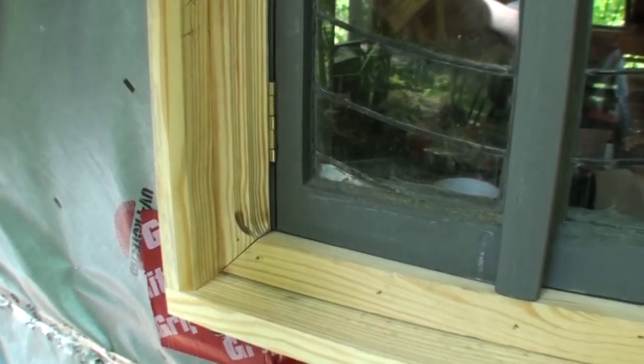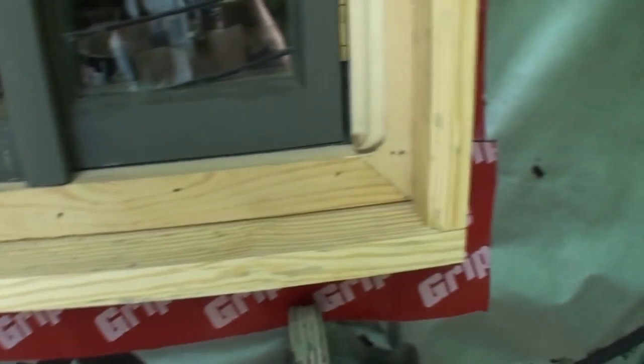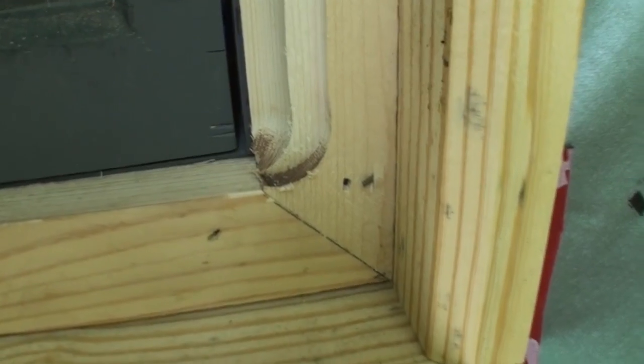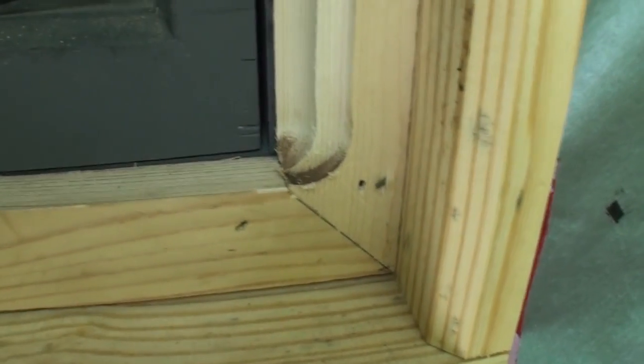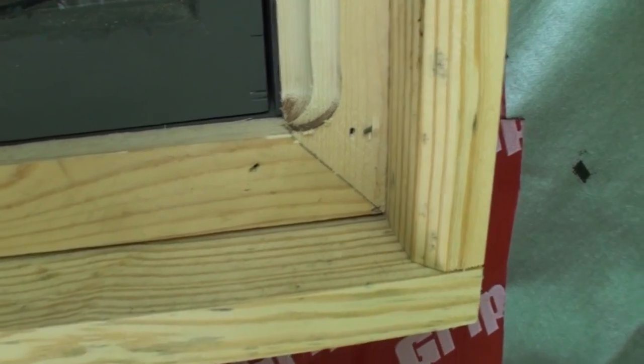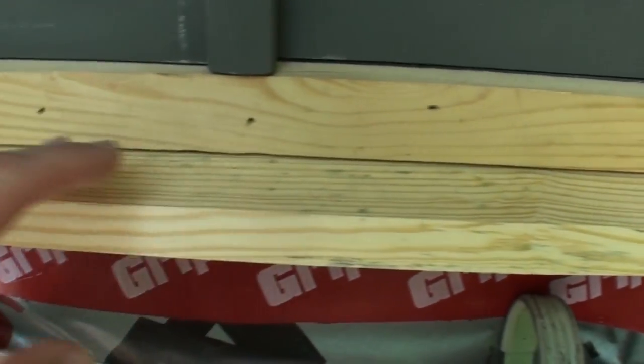The dimensions changed a little bit when I was shifting around the arch at the top. But you can see there where I just kind of stopped the router right at it, transitioned to that lower strip, got a couple nails sticking out. I'll punch those in and spackle those holes up, and then I will caulk all the seams so it'll all be nice and seamless in the end, and then receive its paint job.